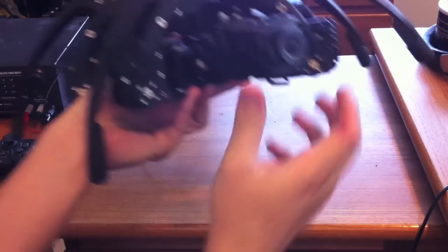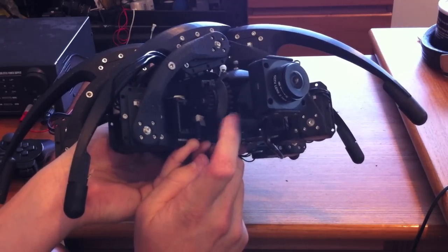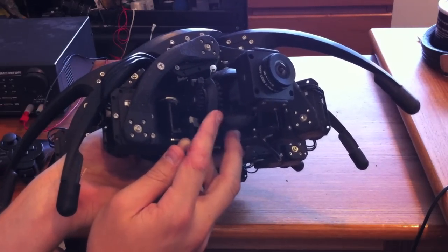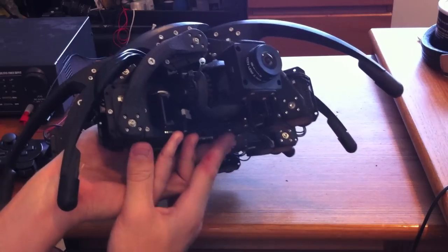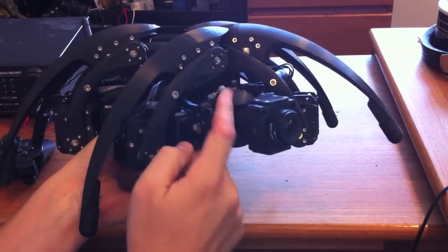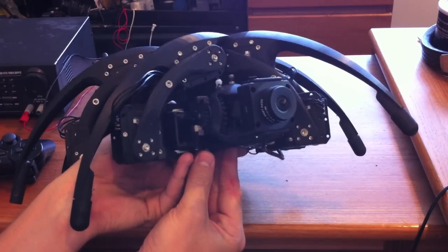The next part is the head mechanism right here. This took the longest to design. The gears look a lot different from before — these gears are much better. They're designed using the involute curve shape, which is a pretty popular method for gear design. It makes the gears operate much more smoothly and they function a lot better, and they're stronger than the previous method, which was just a bunch of triangles cut out of a disc. I still am tweaking the calibration of this particular head, but overall I can tell it's much stronger. What also adds strength is this new gear housing, which is kind of like a differential housing in the way the gears are set up. Basically I made a sphere and cut out places for all the gears — it's much beefier. The other one was a little flimsy and parts kept breaking.